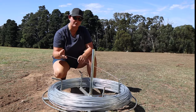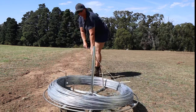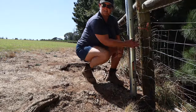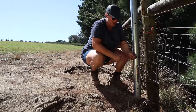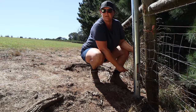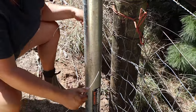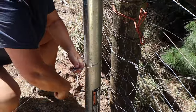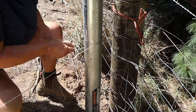Love this piece of equipment — it's really easy to wind wire off and on, so it's dual purpose. All of my livestock are on this side of the fence, so we're going to tie off all wires on this side just to give it a bit of added strength. As this ground wire is going to be the base for my fence, we're going to make sure that we tie it off with the correct knots. You don't always need high tensile wire — I'm currently using Murray's medium tensile, which is well and truly strong enough and really easy to use. Very pliable.